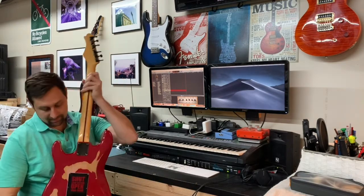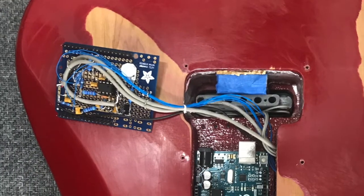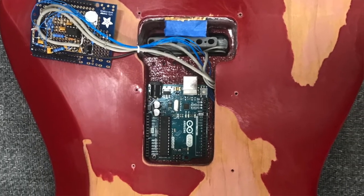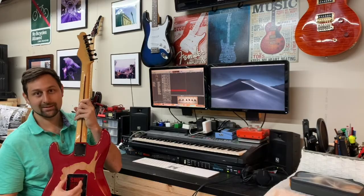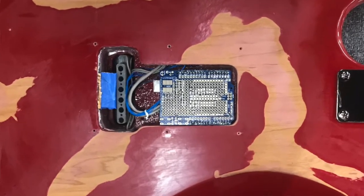They have a couple different variants. I had an Arduino Uno laying around, which is the simplest one, so I went ahead and built that. Instead of building it into a pedal, I decided to build it into a small form factor board that I could fit in the tremolo spring area on the back of the guitar. I removed the springs, blocked the tremolo, and the Arduino Uno board is pretty much exactly the right form factor to slide in there, with a custom shield I built on top to do the wiring and some other stuff.